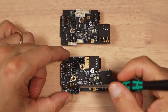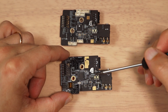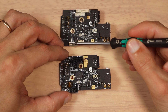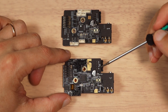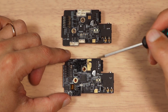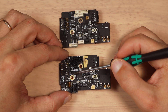If you use an NTC thermal sensor on your toolhead, there is a good change for you too. The TH0 header is located in a better position compared to the previous generation. In my case, it was right behind the wall on the extruder and was preventing a good connection. The new board has exactly the same 12 to 24V, 9-amp power input and ADXL345 sensor. The previous generation had independent fan-controlled voltages, but on this board we have the same voltage for both fans — the part cooling fan and the hotend fan.